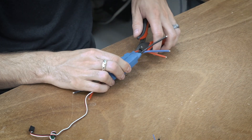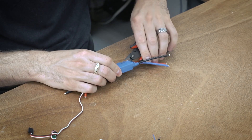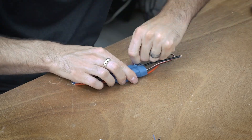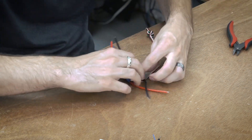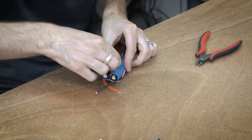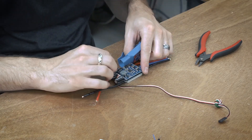The very first thing you need to do after picking your ESC is to cut away the outer heat shrink wrapping to verify that you have the right processor and that you have the pads you can use to program everything. Unfortunately, a lot of these ESCs go through multiple hardware revisions, so it's never really guaranteed they'll stay exactly the same. If you bought one a year ago, it may not have the same hardware configuration as one you buy now, so you do have to check carefully.